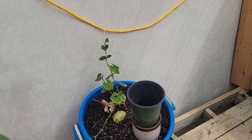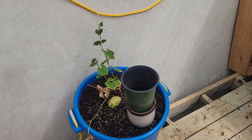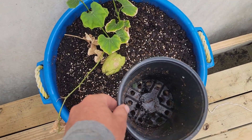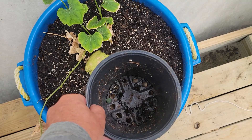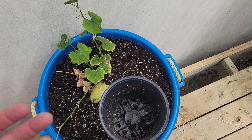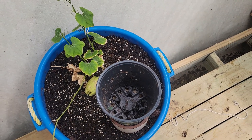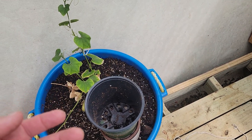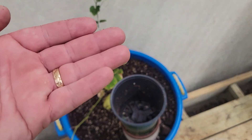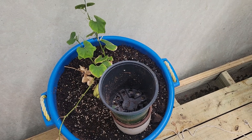Basically, when you drain a pool, at the bottom of the drain — and I don't know when this became code — there's actually a removable cap on the bottom which opens it up to the earth underneath. I don't know if mine has it, but this seems to be the solution for those concerned about heaving. If you have a hole on the bottom drilled into the ground, as water heaves up it comes through that hole, brings dirty water into the pool, then drains out. Apparently that's how you keep a pool from heaving.